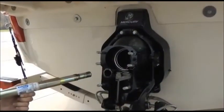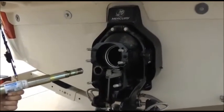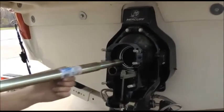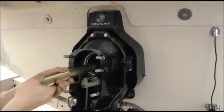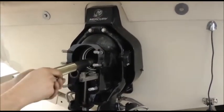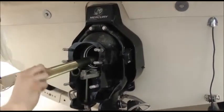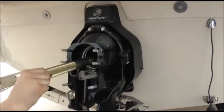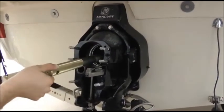Now that we've removed the drive, we're going to check the engine alignment. Jimmy's going to use our Mallory Marine engine alignment tool, inserting it through the outside bell housing and bellows into the gimbal bearing and all the way into the engine coupler. You should be able to turn this freely — basically with two fingers. If you can do that, you're in pretty good shape as far as alignment is concerned. I also like to turn the engine over and check it in a couple of different locations — this one's looking pretty good.